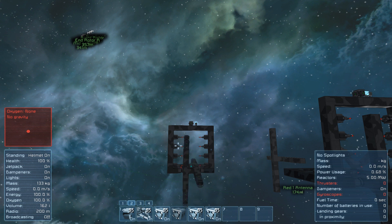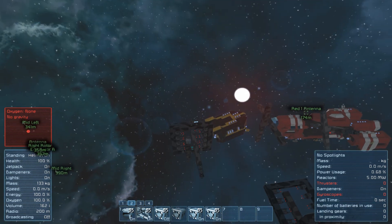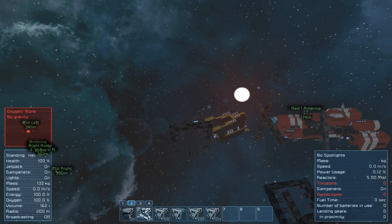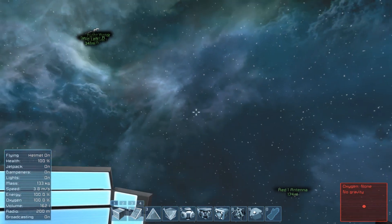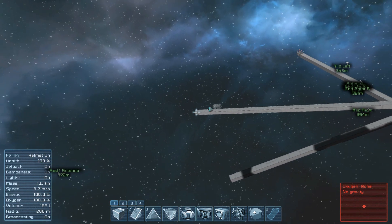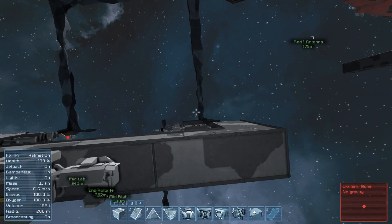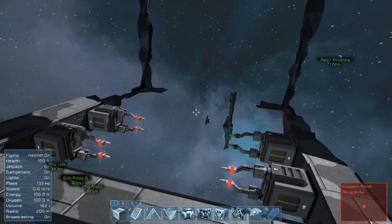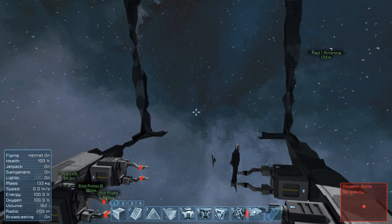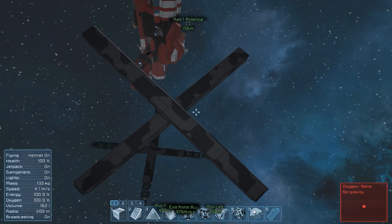At 25 RPM you haven't got enough force yet. So I'll try and launch these in a sensible direction - there you go, that one came out and it's going about 45 metres a second. It would probably work better with a timer setup rather than me doing it manually, or even a sensor setup so when they pass a specific point the sensor activates. I did try that with this one - there was a sensor on the end and when this passed it would launch, giving a really consistent firing line. But it was a lack of speed again.